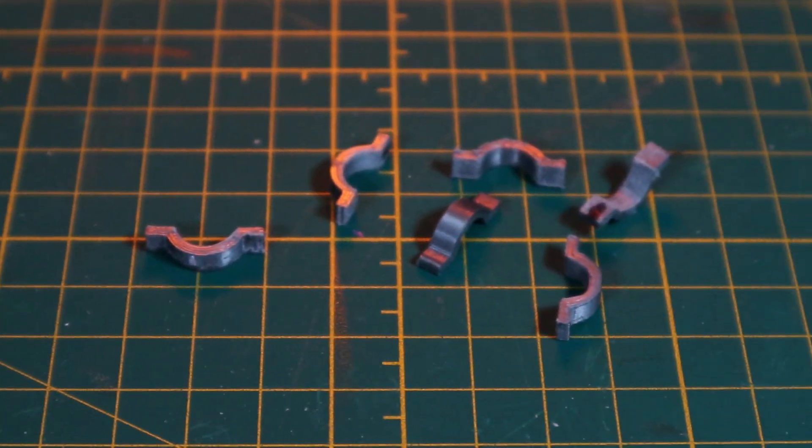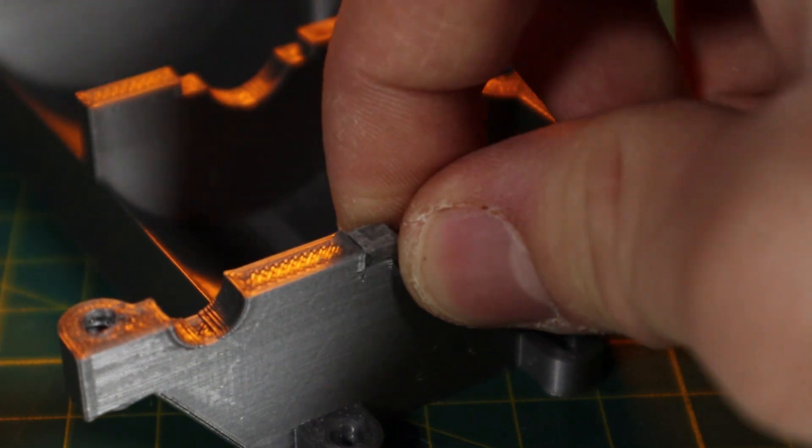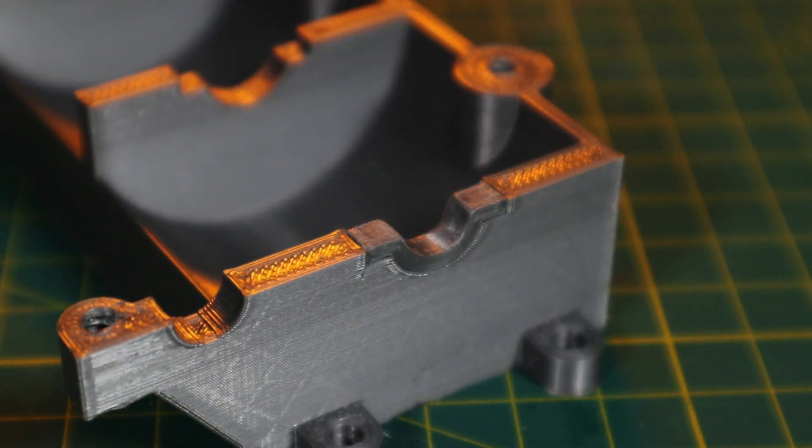There's a second issue with using this approach. Unlike before, I can't slip any bearings onto the crankshaft. The solution was obvious: I printed separate bearing caps that were printed on their sides. The reason for this is that the grain of the print follows in the direction that the crankshaft will be spinning. If you think about a piece of wood, we want to go with the grain, not against it. This will reduce friction and make the engine run a whole lot nicer.